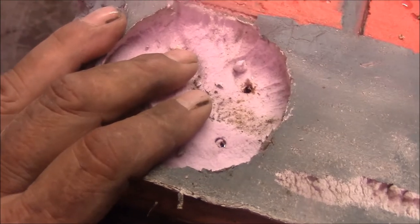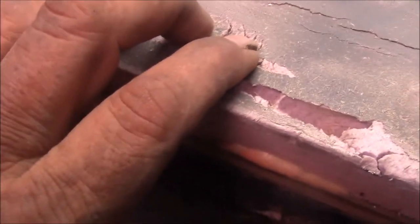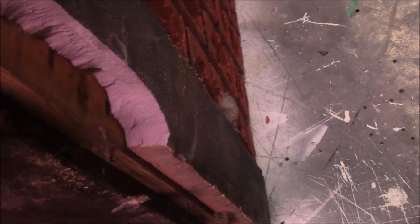I'm working on pillar number three — I've got two done so far. Looking at all four pillars, the two for the entrance and two for the exit, there's only going to be that first pillar that needs foam re-carved. On the others, there's where the bracket for my gate hinge goes — I'm not going to touch that. But I've got some lines here where it's been hit with the weed eater, and one corner here that Kaylee chewed on at the very bottom. The weed eater cracks I can fill in with a paintable silicone caulking, fill it back up level, and then just repaint. I'm not going to replace such a small area at the very bottom of the pillar — if I get some paint in there, no one's even going to notice.